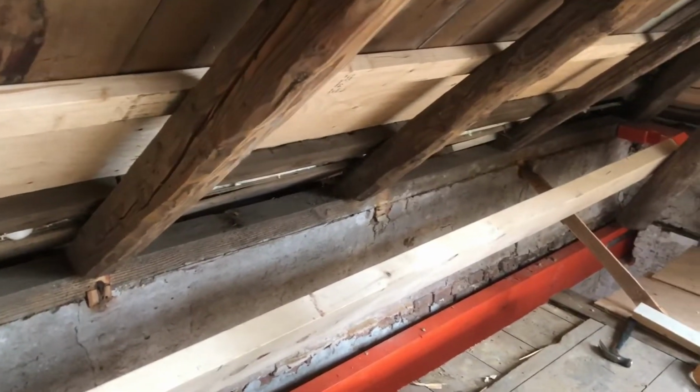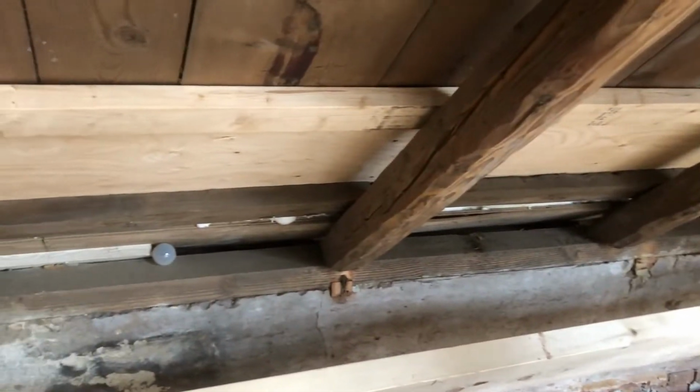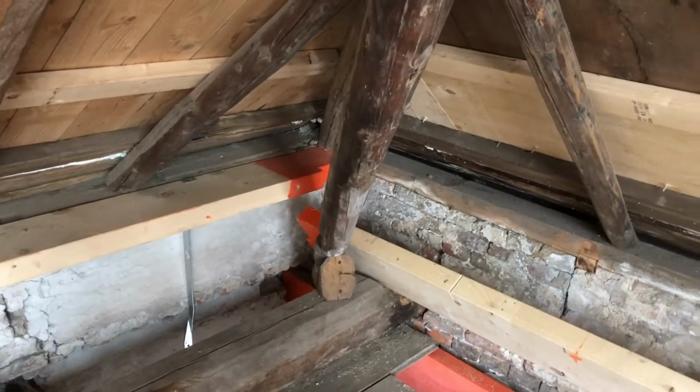So we're going to do that with threaded bars as much as we can put in. We drill holes all the way through the beam to the other side, and we put a thread in there. And I have very thin fingers, so I put these little nuts and the washer behind it. We have just the exact amount of nuts and washers, so if you drop one behind the wall, they're gone. Then we have to wait another day just to get supplies in. Okay, so first thing first, knock off that notch in the end so it will fit. Cool.